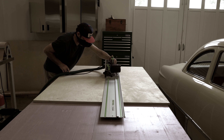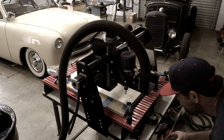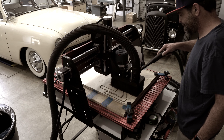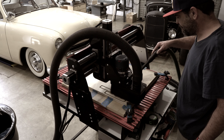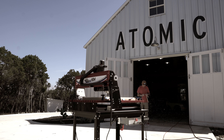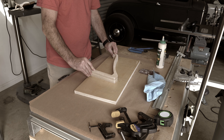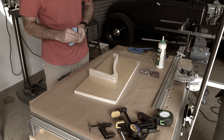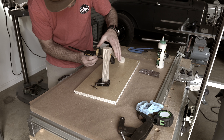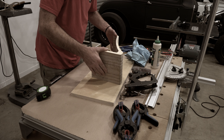So I got to work processing some three-quarter inch birch so that it would fit my little CNC table, then got my setup done. I was having some issues with chatter on the CNC, but the pieces were coming out nonetheless. It was the dust from cutting all of these profiles that was killing me, so I eventually moved the whole shebang outside and continued cutting profile after profile out on my driveway. Once they were all cut, I could move on to the glue-up, which took both a lot of time and a lot of clamps. It was important that I get each profile aligned well to one another, so I first glued up two pieces, then glued that assembly to another, and so on, until finally I had my finished part.